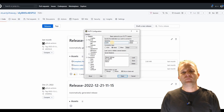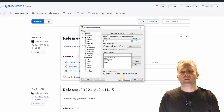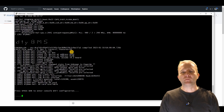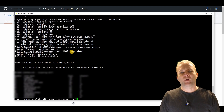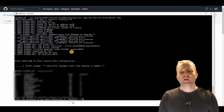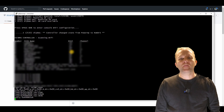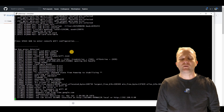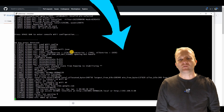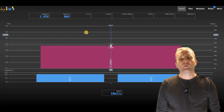Now we need to configure Wi-Fi. For this you will need a serial console program — I'm using Putty. Connect to the same COM port as was used to program the ESP32, in my case COM4. Press the reset button on the ESP32 and wait for the press spacebar prompt to appear, then follow the instructions to select the Wi-Fi connection and enter your Wi-Fi password. After this the controller will reboot and attempt to connect to the Wi-Fi settings you provided. You can see the IP address on the console and also on the TFT display if it's installed. Fire up the web browser and open the DIY BMS page.